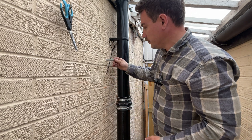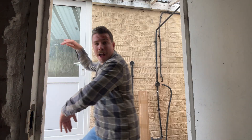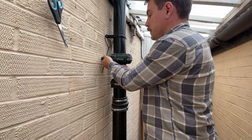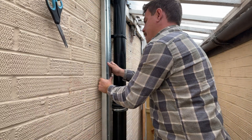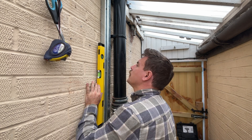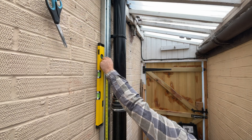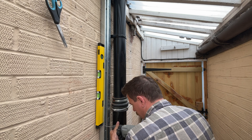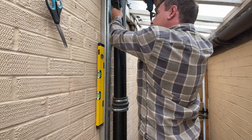There we are — a 12mm hole. I'm going to need a hammer for that. Most people know how to fix something to a wall — use fixings, make it nice and strong. I'm using my first fixing to mount the unistrut to the wall. This allows me to get it nice and level for my remaining fixings. This should mean the unistrut is nice and secure. Once we know it's secure, we can then move on to our second unistrut.